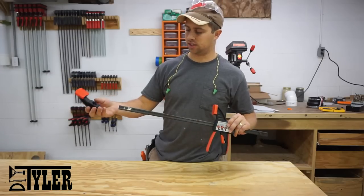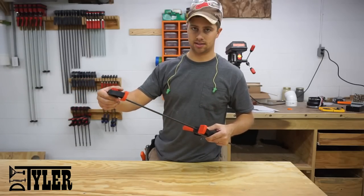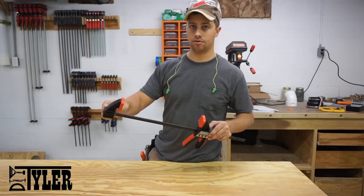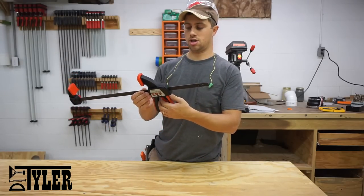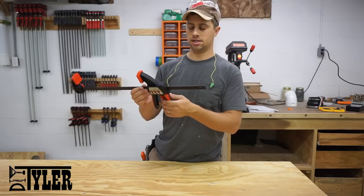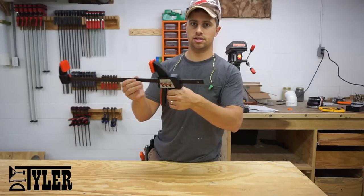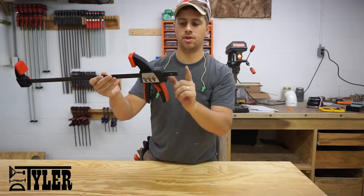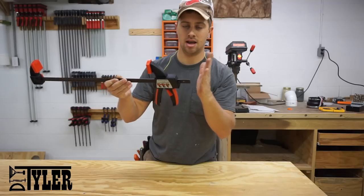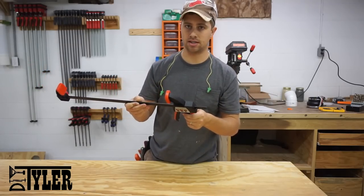When you're done grinding off the stops, you should be able to remove and slide the stop end of your clamp up and down freely. You can stop there or you can choose to grind off the other end so that you have a little bit more clamping space on the bar. I am going to remove this because you can see the clamp only goes so far. I want to remove that so I can move the clamp all the way to the end and not have that as a hip-piercing hazard on the vise.